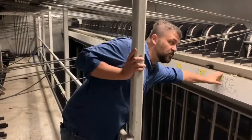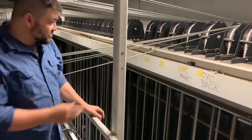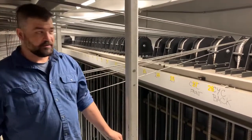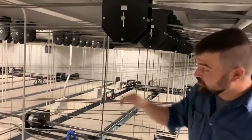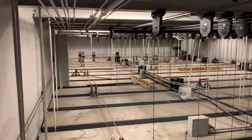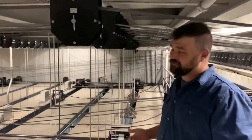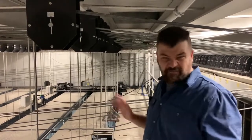Because we don't name things complicated in theater, the beam that holds up the head block is called the head beam. What this does is holds all the weight of this entire system — that's why that is a massive piece of structure. From the head block, we move out to the first block, the loft block. In our system, we have six loft blocks. This will vary depending on the size of your theater. Some will get up to seven, nine — I think the biggest I've ever seen was 11, but that was a really wide theater. Five to seven is about normal.